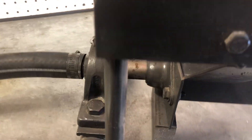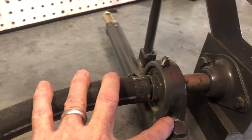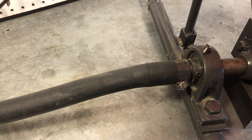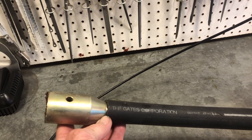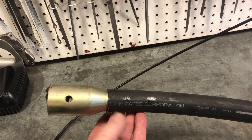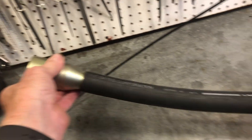The way I drive this is I have a shaft coming out here, and this is a bearing that I mount here — it can be greased with a grease gun. For the drive shaft, I just used a rubber hose and I clamped the hose on the shaft. At the other end I left it loose on this adapter so that if it ever got in a bind, the adapter could spin inside the rubber hose. This is how the tractor drives this spreader — through this rubber shaft which is just a piece of hose.